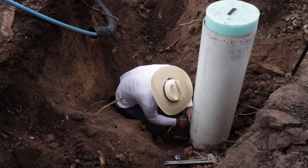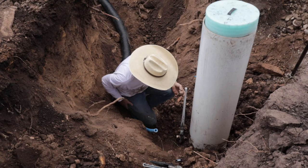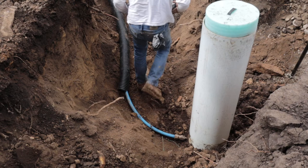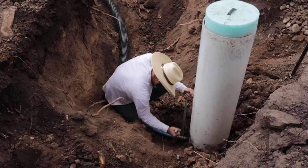There are actually two valves on the meter. There's one inside that white pipe at about five feet that you can open or shut off if needed, and there's also a black steel pipe to the right that's a valve you can access from the street. When I first put this on, there's supposed to be a stainless steel insert inside the blue pipe and I forgot to put it on. Once I realized that, I had to take it back apart, put the stainless steel sleeve in, get it tightened up, then tighten up the other end.